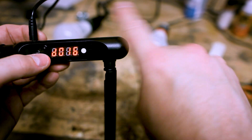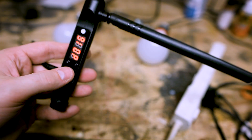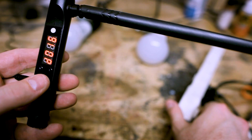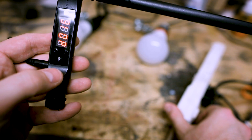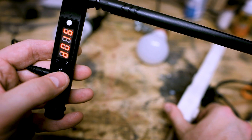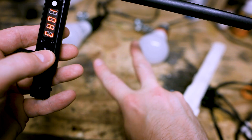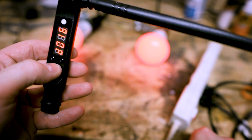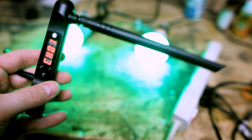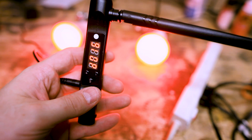So how do you pair your bulbs to said channels? It's actually very easy. What's going to happen is I am going to turn on the bulbs, and within three seconds of turning on the bulbs, you're going to hit the SET button three times. I'm going to put both bulbs on channel one. I do this — one, two, three — and now they blink green three times, which means they are paired to this transmitter. Both bulbs are now paired.